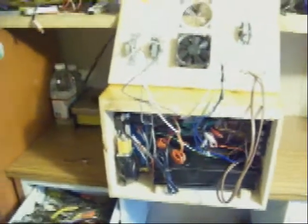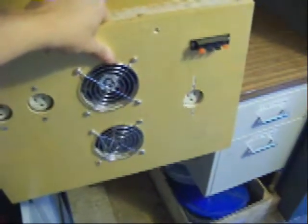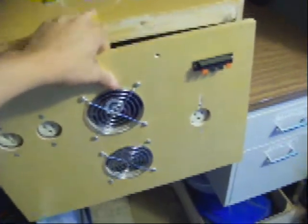And put the antenna in, it's real easy. You just slide it in there and put the bolts back on, and you're done. And I could even add a subwoofer if I wanted to, because it's got a subwoofer output. And could definitely be upgraded fairly easily. And this whole cover just slides on. Slides on like this. Two screws on the top and two screws on the bottom. I got to push the wires in. And that's it. High performance boombox, 360 watts, which could be easily upgraded with a larger amplifier. But I'll smoke those speakers before I run out of power. I almost burned them already testing. A speaker there, everything's got handles. That's the radio. Okay, she's fired up.